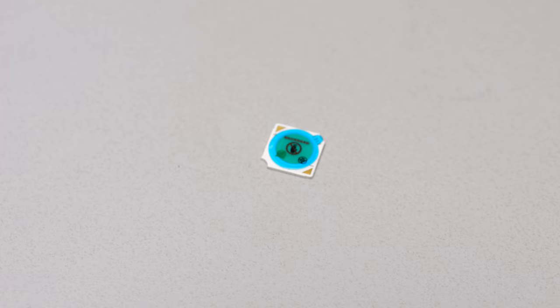This is a piece of lighting frost that I'm going to use to diffuse the LED. What I did was cut a notch in the top of the heat sink — the flexible gel can be mounted at the bottom, and then I'm going to make a little bracket that will hold it in at the top. Hopefully with a small 16 millimeter frame the diffusion should work pretty well.